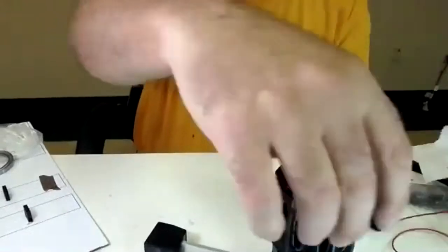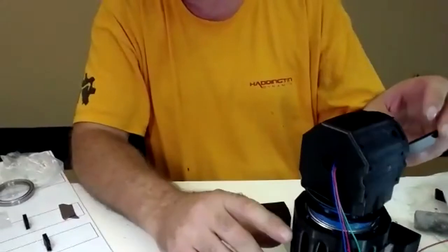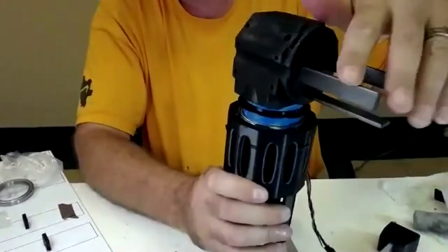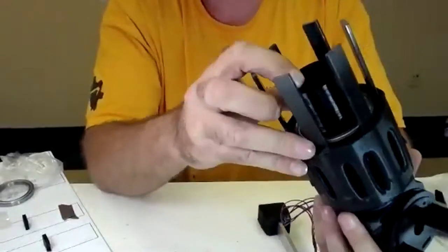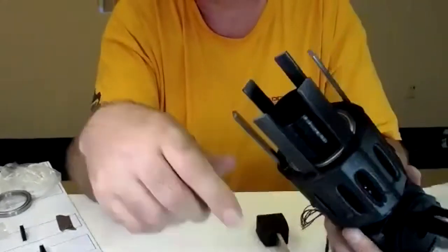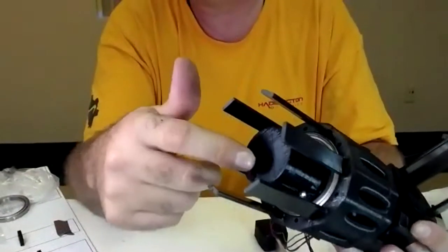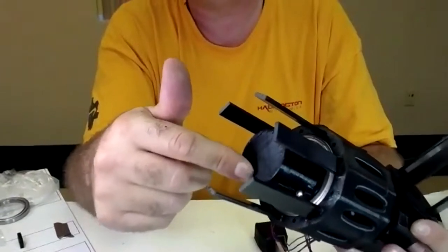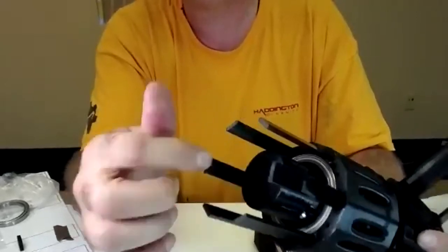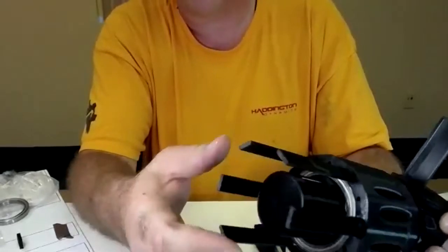Give this a rotation while it's drying. Just come by, rotate it. What you might notice is that the friction you're feeling isn't from the bearings. If you actually lift this up and rotate it, it runs very smooth. But what you'll find is this end cap cover will kind of rub on the base. Now, this was a nice addition. We were building these without this cover and dinged up a few of our harmonic drives. Those were sad moments. But James Newton, one of our first customers, said, put a cap on it. And so we did, and that's how all the products ship in your kit.